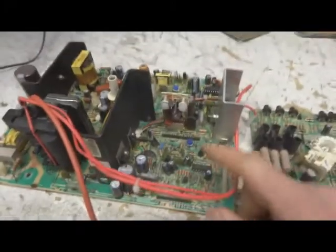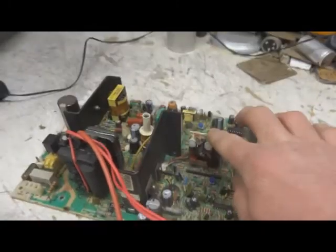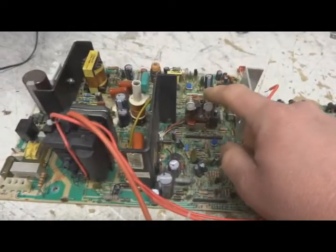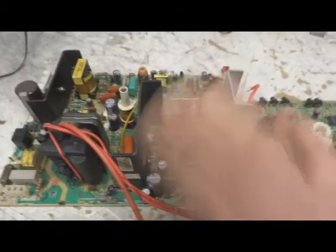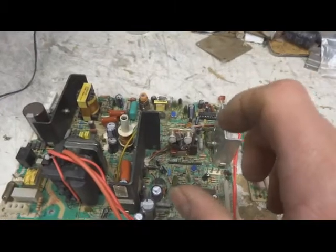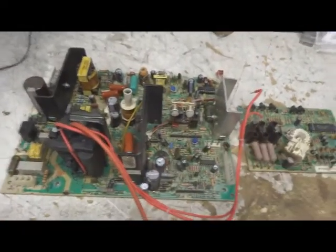I also have the Pincushion board on the one that is running. I'll try to show you an example of what this does. This is the reason why you need this for a 27-inch. The chassis have some other differences between the 25 and 27, so they're not compatible. If you were to just stick this board on, you have to change a couple other things.